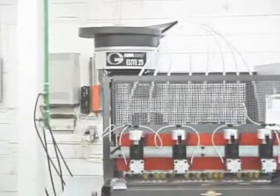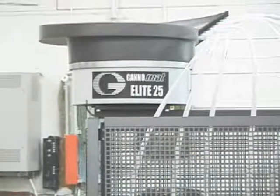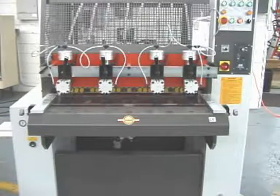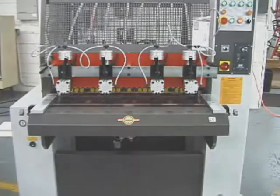The Elite 25 is a fully automatic drilling machine with gluing and inserting. It features a 5-second drilling, gluing, and inserting cycle, a closed glue system, and a self-diagnostic electronic programmer to control all machine functions. The machine can also be ordered as the Elite 50 with the addition of a 25-spindle vertical drilling unit programmed to function with the horizontal drilling and inserting mode. The Ganimat Elites are the perfect complement to any CNC machining center.